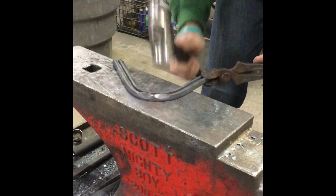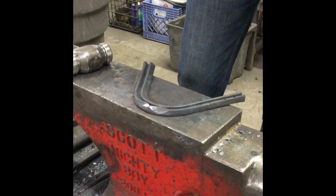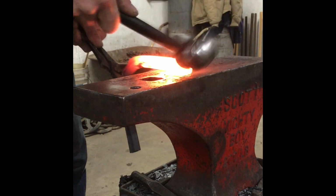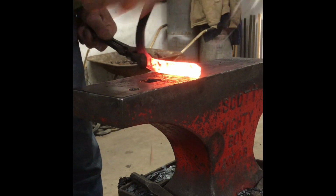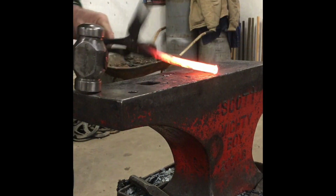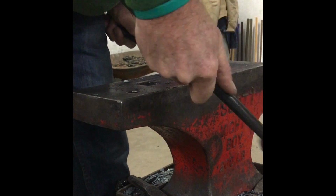And you can see my bump right there. Just kind of making that nice and round again. When doing a concave heel, it tends to get narrow. So make sure your blows are upsetting and not pinching. Pushing each corner back into it. Pushing it back in. And now I have a lot of thickness and I can come and flatten it up. And start the whole process over again.